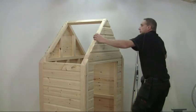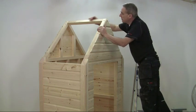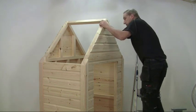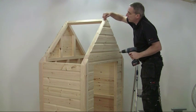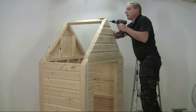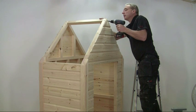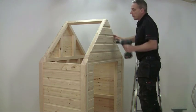The roof's next - that's dead easy. We're going to use plywood again but we need some support, so I've put in a ridge piece which is a piece of 45 by 45 material screwed through from either end. When you drill through, just position the hole carefully so you miss the screw that's holding the two halves of the frame together. Position it in line and away we go - pull it up carefully. That's nice and firm, and now I can cut a couple of pieces of plywood to go on the roof.